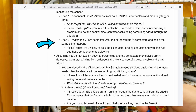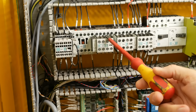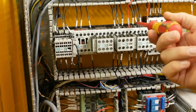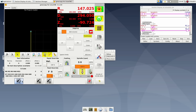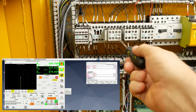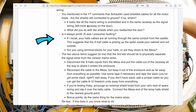Next troubleshooting step: since I've got a spare contactor — the one for the coolant pump which I haven't hooked up yet — I'll switch the three-phase power over onto this one and manually activate it to see whether I get the same interference on a different contactor. That may indicate worn-out contacts arcing within one of the two contactors, though it's unlikely since both are behaving almost exactly the same. Same result — the machine e-stopped. If it's not the coils and it's not the contactors, then it's probably the wiring.